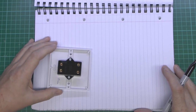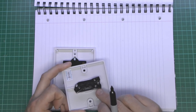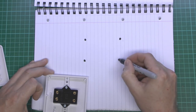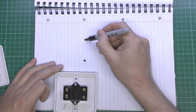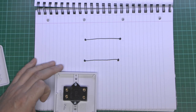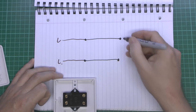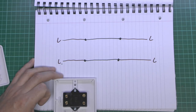And the third type of switch is the intermediate, which has four terminals. What's inside is essentially two of the previous mechanisms. So on one side we have two terminals, and then the other two are on the other side. In one position, this pair is connected together and this pair is also connected together. In terms of wiring, you would typically have two wires coming in — both of which are lines, of course, no neutrals here — and two wires coming out, which are also lines.